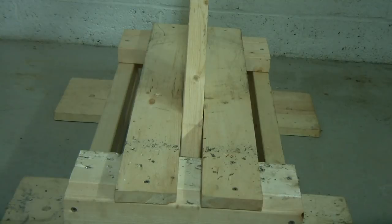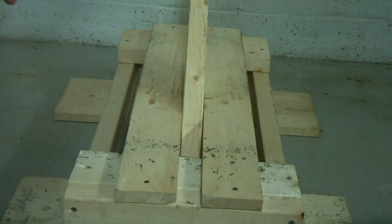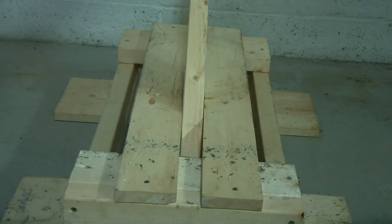To build the target itself you're going to need about eight feet of two-by-fours, then about four feet of planks — I believe one-by-five-and-a-quarter, though you could use two-by-six, it won't make much difference. That's really just for stability to make sure the target is on a flat surface. You're also going to need some smaller boards. I took two two-by-fours, 24 inches in length and 14 inches wide, and strengthened them by putting pieces along the side and top for added security.